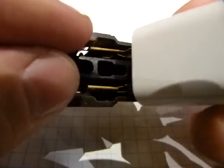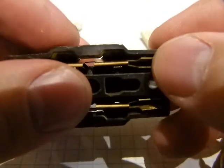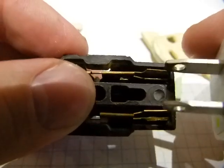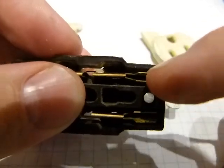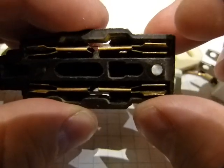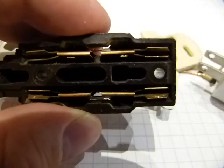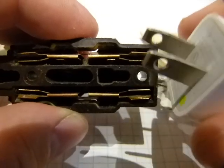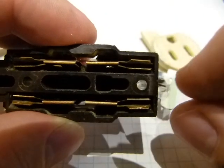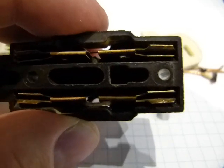Why this happens is because over time there are two reasons. Over time, the thickness of the copper plates that the prongs are contacting — they wear away, so these copper plates get thinner. Also, the distance between the two plates that provides a snap fit for the male prongs on the plug increases — they get bent outwards. And instead of a proper snug fit, it provides a loose fit.